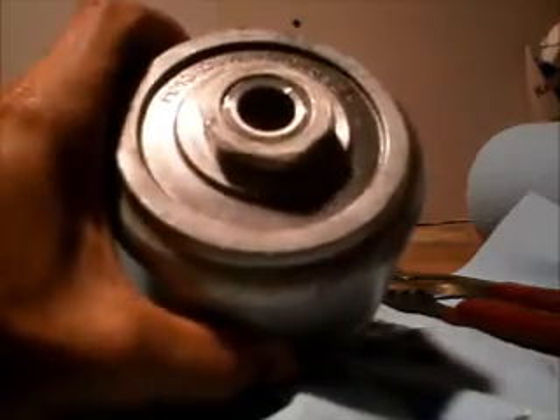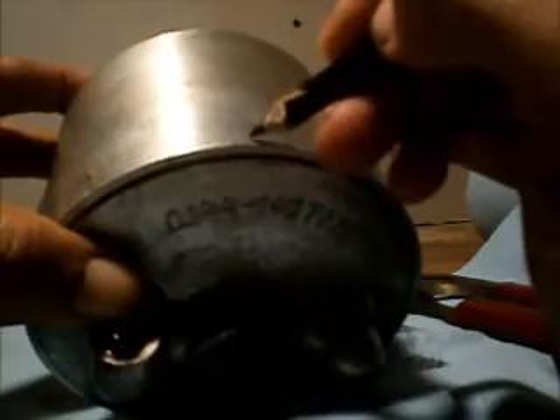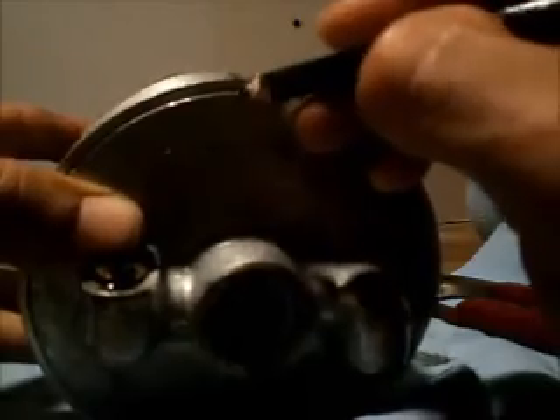Alright, let's get this thing into the shop and get it opened up. Okay YouTube, we're here in the shop. There's the inside of our old filter. What we're going to do is come down here on the base and make a little reference mark — one on top and one on the bottom. The reason we're doing that is because this is a balanced assembly, so we want to make sure we put it back together just like we found it. Once we've done that, I'm going to go ahead and spin this top bolt off.